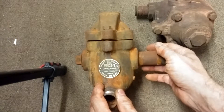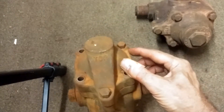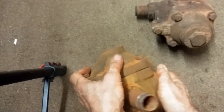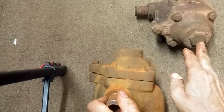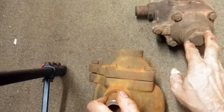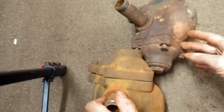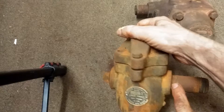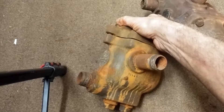There were several varieties there. You can see 0026, and they come in two basic types. This is the old style, and this is the new style. The new style enabled one to pop the cap off and gain access to the thermostatic element and replace it without removing the cover. You had two choices of your inlet on either side, and your outlet could either be here or here. And this was the clean-out plug.